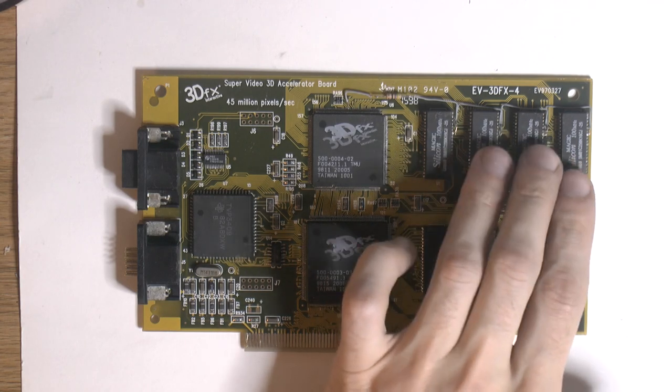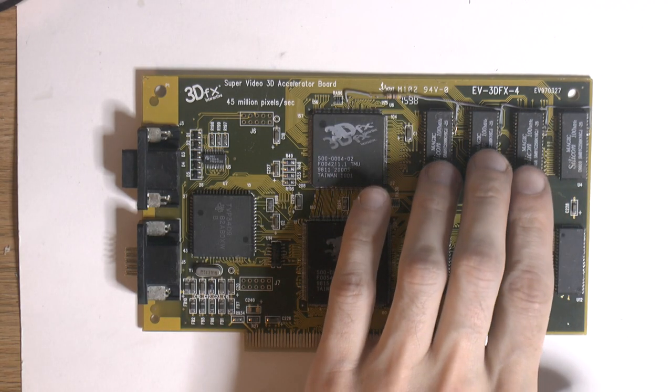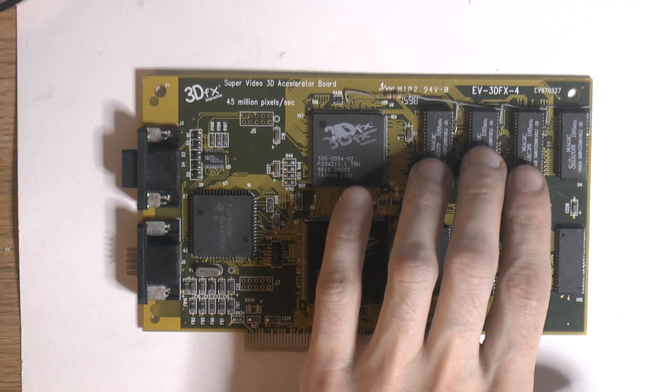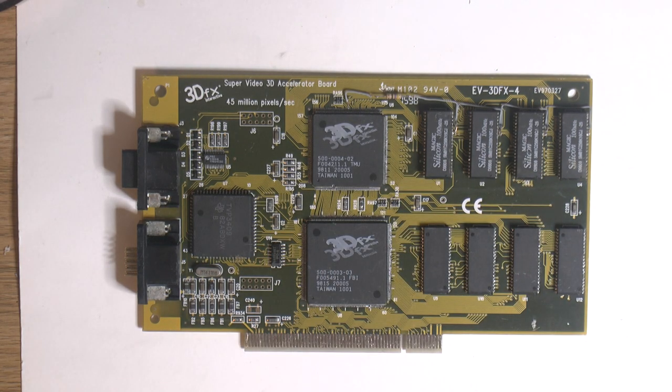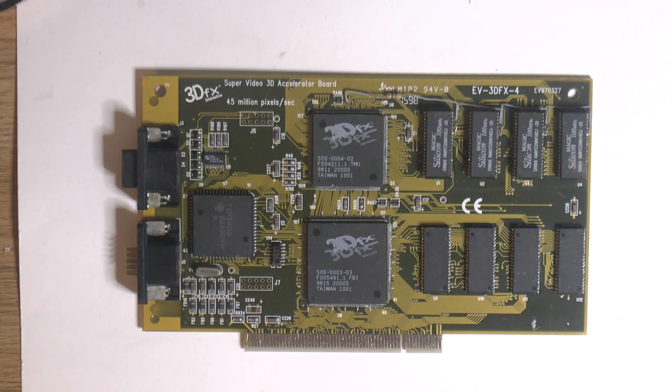Tested the card with 3D Mark 2000: 550 points without the extra RAM and 1050 with it. And Quake 3 can run at the same texture resolution as Voodoo 2 now, without losing frames really. So we need to fix all this in place with the glue put here.